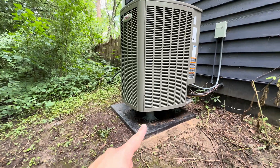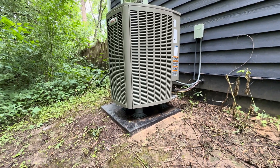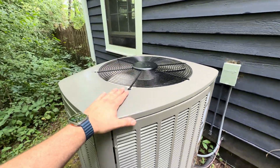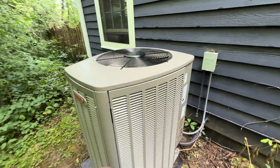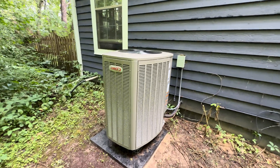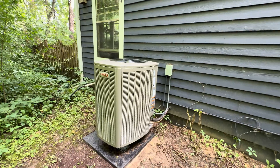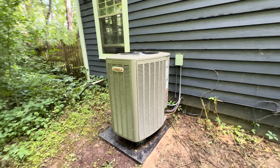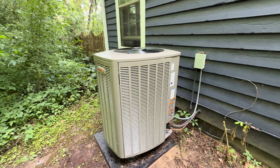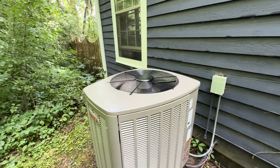We have it elevated on legs because it's a heat pump — when it runs on heating mode, there is a little bit of condensation and we want it a little bit above the snow line. This is a mid-range heat pump from Lennox, designed for dual-fuel operation. When the temperature outside is in the 40-degree range, this unit will still produce heating down to 5 degrees, though it loses some efficiency and capacity. Between 30 to 40 degrees, you're going to be able to heat most of the home just using the heat pump with superior efficiency and comfort, then switch into the gas furnace whenever the outdoor temperature gets colder.